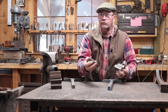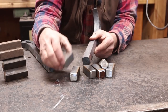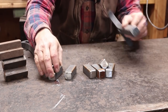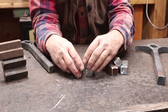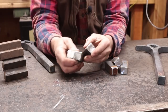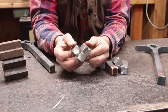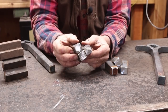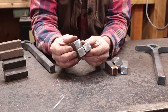For these v-blocks I've cut six pieces of one-inch square bar. This is supposed to be a one-inch square bar, so one-inch square bar gives me just the perfect die top and bottom. You only need two pieces forming a V like this, but welding them up with a block in the corner holds the form and keeps the angle at 90 degrees. If you let the angle close in or open up, you're going to create another problem rather than solving one.